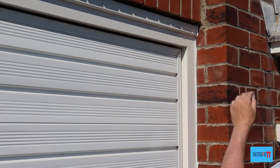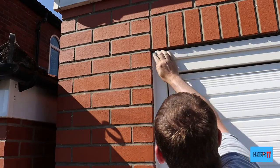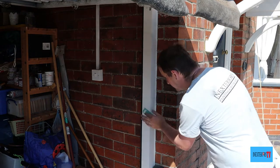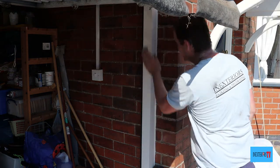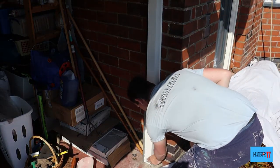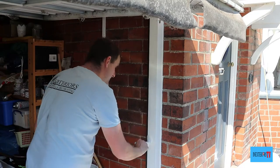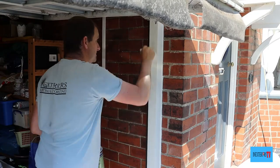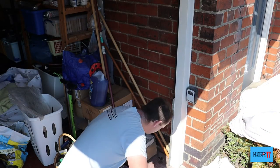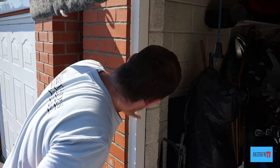The only bits of caulking on this frame are two bits in the left and right hand top corners. When we sanded and scraped, there were some bits that went back to bare wood, and with this being a primer undercoat you can just start painting away. But those bare wood areas won't be as covered as the bits that weren't bare wood, so I give those areas a light sand down and then just give them another coat of paint. Always remember: if your undercoat is solid, your top coat will be solid. It's all about the preparation.